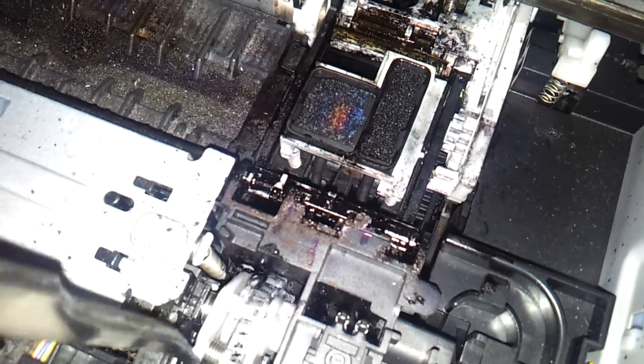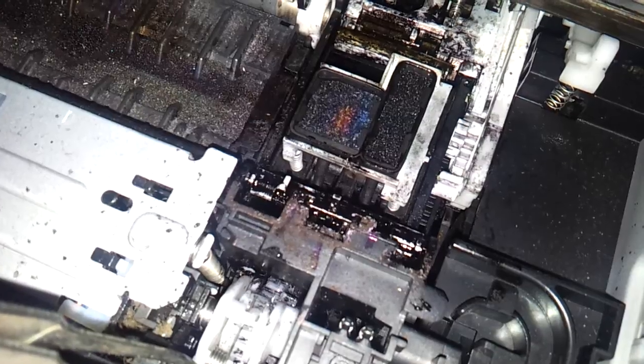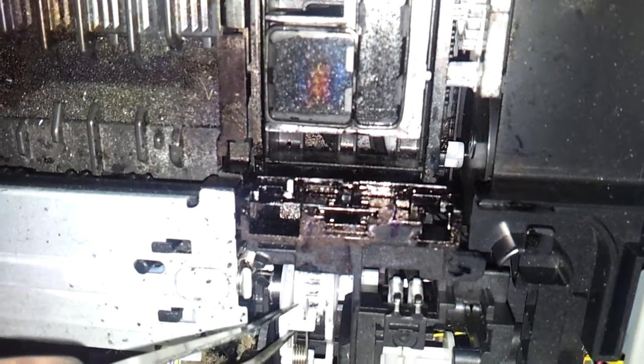The problem is this goes like this, and because of the wiper blades it gets stuck right there — because of the ink that is spraying down onto this gear. You can see that part just juts out there; there's a gear below that gets stuck on this plastic bottom. There's a notch on that bottom where it gets stuck, so that's the gear — this gets stuck and won't turn the cam.